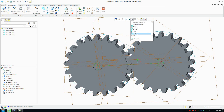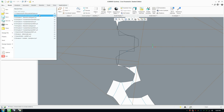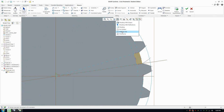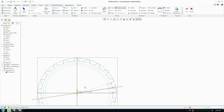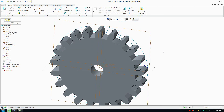The gear isn't meshing very well, so let's fix that quickly. Open the part file, find the interior cut feature, right-click it and select Definition. The cut needs to go deeper. Delete the existing sketch references, then use Project to create copies of the correct curves — this curve, this curve, and this curve — so the cut is deeper. Remove everything else, click OK, switch to shaded view, save the file, and go back to the assembly.